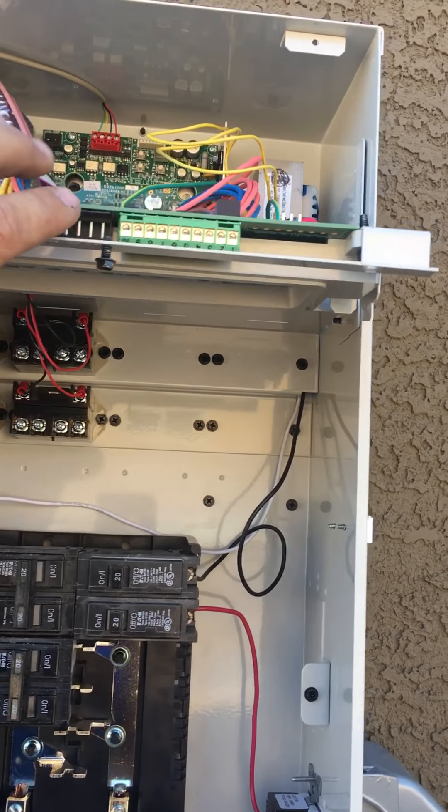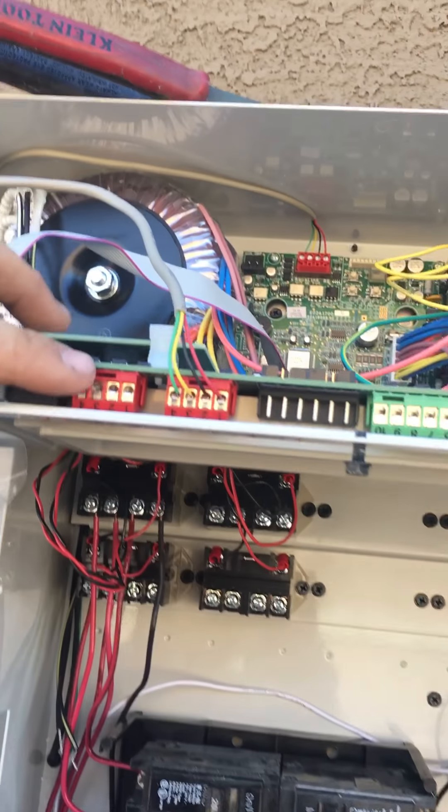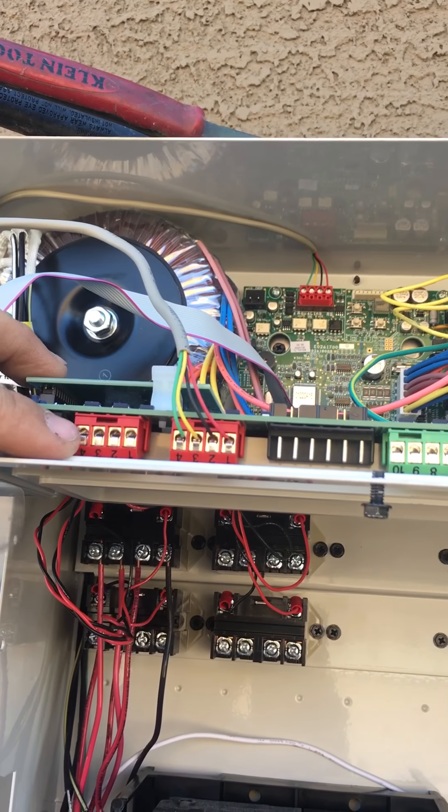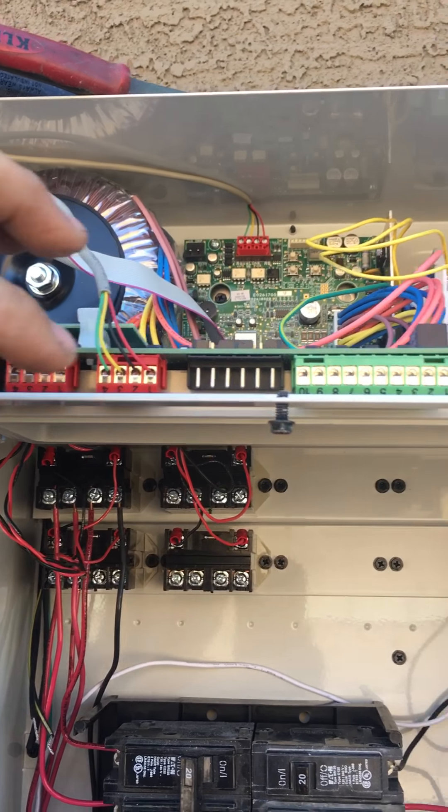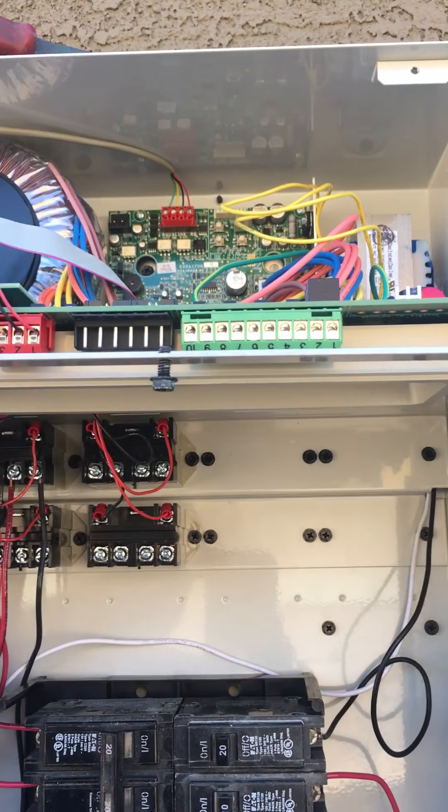I know you're not going to be doing all this, but you need to know what you're looking at when you have other guys coming in to do stuff. What he probably did was he ran it on the 4-pin. There's a 4-pin in the heater, but we don't use a 4-pin in the heater. What we use is the 10-pin. The 4-pin is supposed to be for communication — you run it for your pump, your handheld transmitter, everything else. But the heater used to have issues.